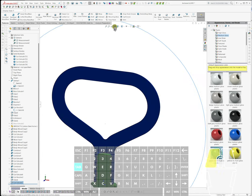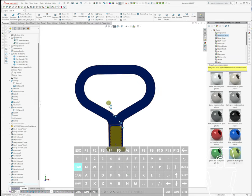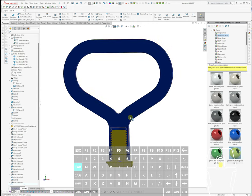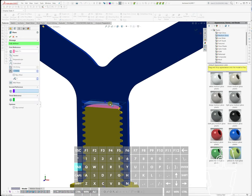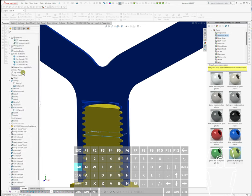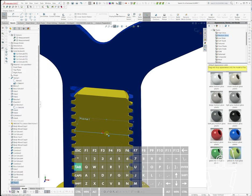All right, so now I have split them. All right, how am I going to join them? I need some sort of pins. Let's create a plane off of here. That's just the direction. Flip offset. Call it an inch for now. I can adjust that later. Put a sketch on there, and make myself some sort of dowel pins, preferably with a capturing feature.